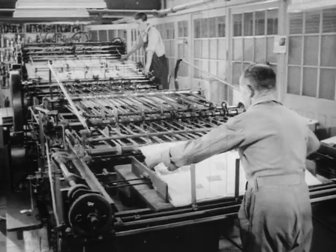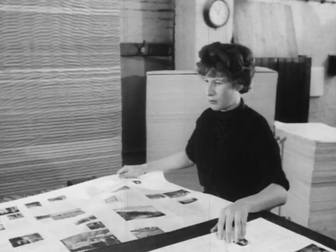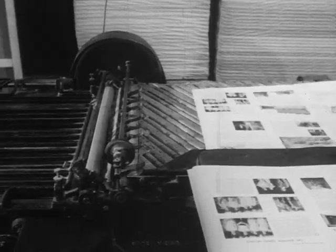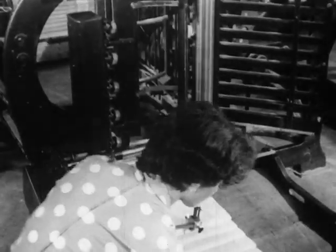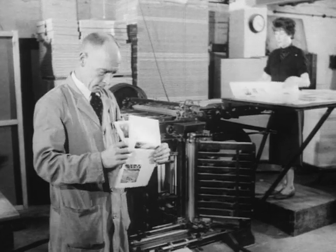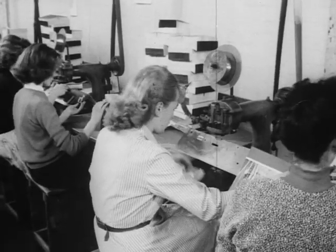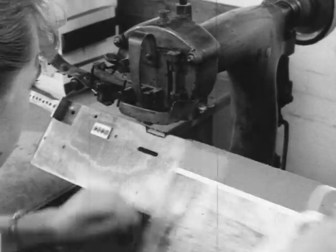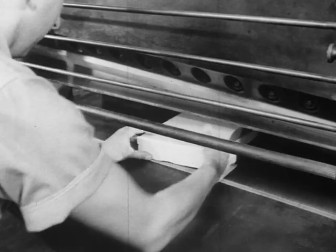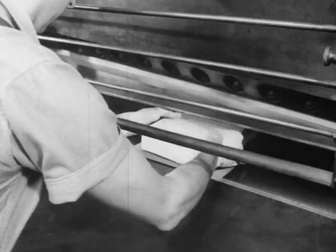An average issue has some 40 pages, and eight pages at a time are printed on one large sheet of paper. The printed sheets are transferred to the folding machine. The single sheet, as it comes off the press, is a seeming jumble of pages — some one way up and some the other — but there's a method in it, and it all comes right in the folding. The folded sheets and the cover are assembled and bound together in a stapling machine. The edges of the folds are cut away, leaving the pages free for turning. The job is done. A new issue of 9,000 copies is ready for distribution to the Babcock community throughout the world.